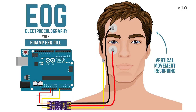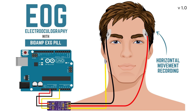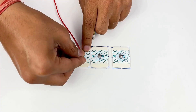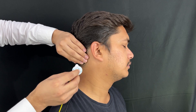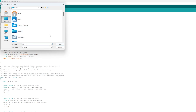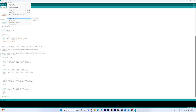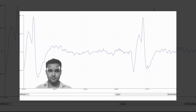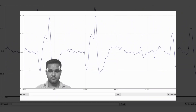Let's move on to the next one — the EOG signals, or the signals generated from your eyes. You can either do vertical EOG recording or horizontal EOG recording. Placements for both are different, so refer to the diagram shown on screen. Let's go with horizontal EOG recording. Apply the Nu Prep Skin Preparation Gel on the targeted area and clean it properly using a wet wipe. Now connect the bio-amp cable on the gel electrodes and place the positive and negative on the left and right side of the eyes as shown in the diagram, and the reference on the bony part at the back of the earlobe. The setup is now ready — copy-paste the EOG filter code from our GitHub repo in the Arduino IDE, flash it on the Maker Uno board, and open the Serial Plotter to visualize the EOG signals by moving your eyes left and right. You can also try the same process for vertical movement to visualize up and down movements of the eyes.